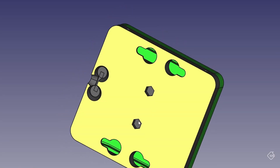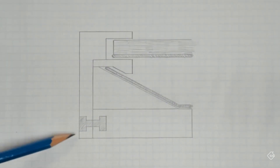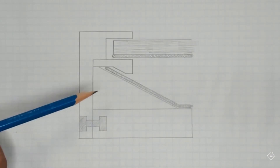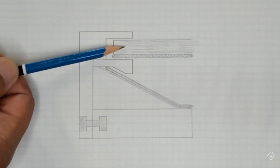There are two other hex pockets which are the other side of the screws holding in our LED chip. A separate part is going to have to be 3D printed and added on later to sandwich those nuts in. The fourth and final part of our enclosure has two functions: it's going to hold all of these pieces together with a locking mechanism, and it's going to make sure our acrylic plastic and diffusion film is securely held in place — everything in a nice, compact sandwich.